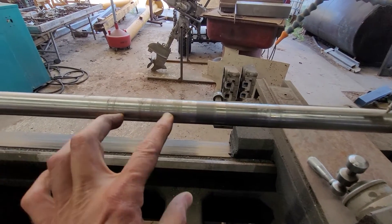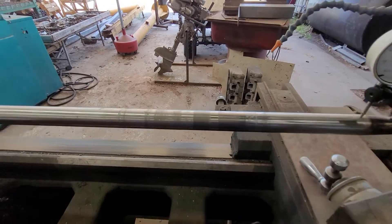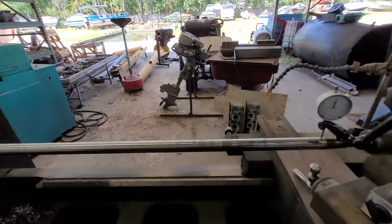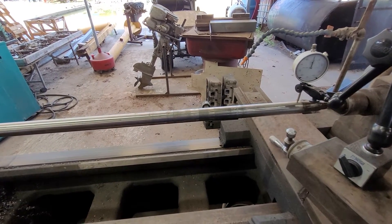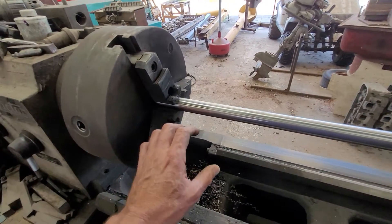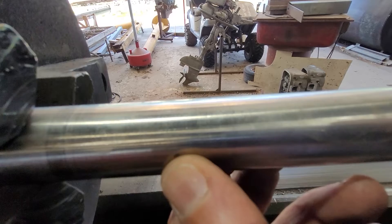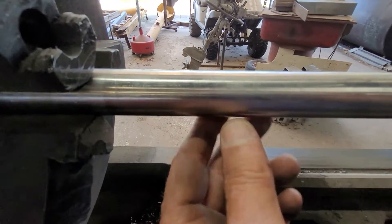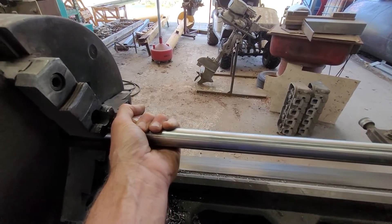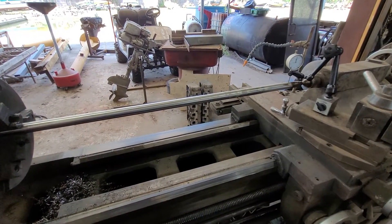This section goes through the coupler — the piece inside the boat that had been rubbing — but since there's no seal right on that it's not a big deal as long as it's not hitting anymore. We also noticed the engine and transmission moving up and down when accelerating the boat in our run tank — the back of the transmission lifting up about a quarter to a half an inch, indicating the rubber motor mounts in the back of the transmission may be suffering. That puts some odd forces on this shaft since you've got a strut down here. If this end is moving up and down and the strut is fixed, that's a serious problem.